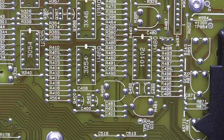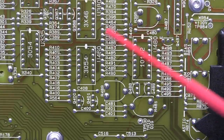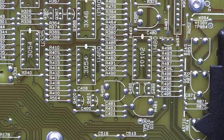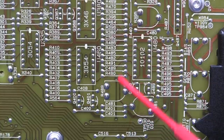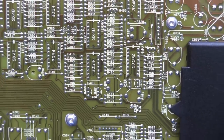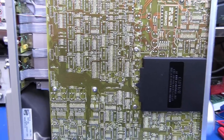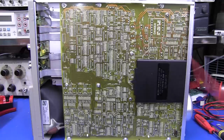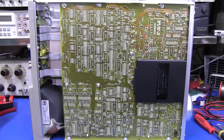One thing I really love about this scope — not only the double-sided layout, but it's all through-hole, which means we can access all components from the back. Every component on the back of this board has silkscreen designators and markings for all the resistors, ICs, and test points as well. It's brilliant — somebody's put a lot of effort into this board. You can troubleshoot everything from the back with the schematic and service manual. Why isn't all gear designed like this?